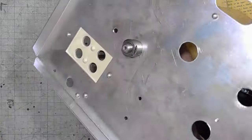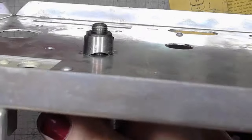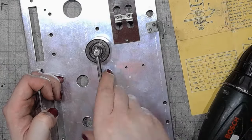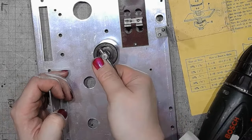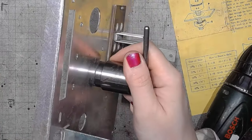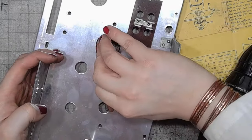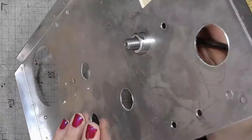If it's aluminum, it's pretty easy. You can see that those teeth have bitten into the sheet metal, and we'll keep on turning as long as the metal is not completely broken. This takes a lot of force. And now — I could hear a click. I'm not sure if you also did. But this would mean that the cutter has bitten through the sheet metal on one side almost completely. And now, on both sides, all that remains is removing the cutter from the hole.